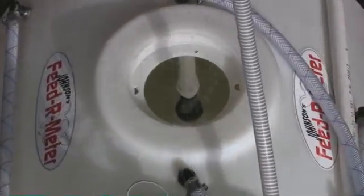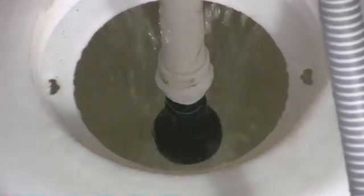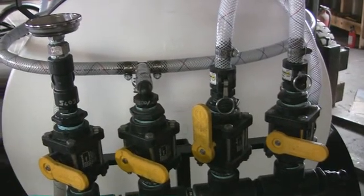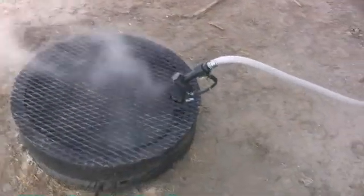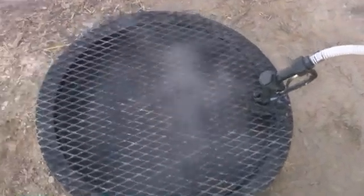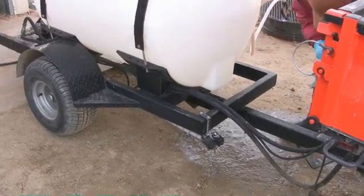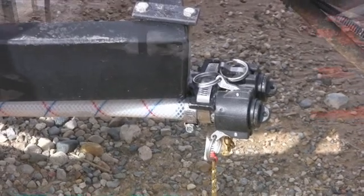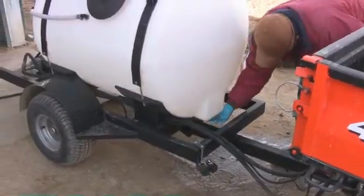This enables the spinner, located inside the tank, thoroughly rinsing its inner walls. After the walls have been thoroughly flushed, turn off valve 4 and turn on valve 3, the feed valve, and nearly empty the tank through the feed line. The entire system has now been rinsed. We recommend that you repeat this process using a cleaning and sanitizing agent mixed in the water. Now just remove the three plugs — this will completely gravity drain the system, making it possible to store the feeder in below freezing temperatures without risk of freeze up.